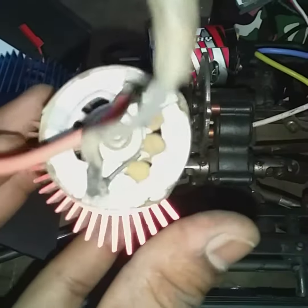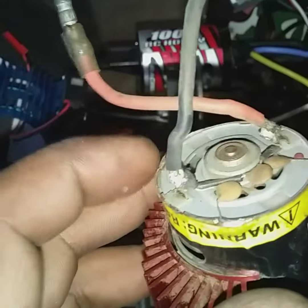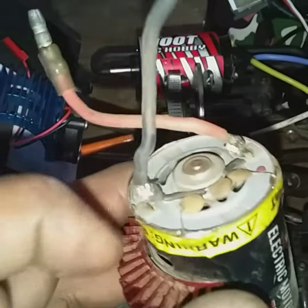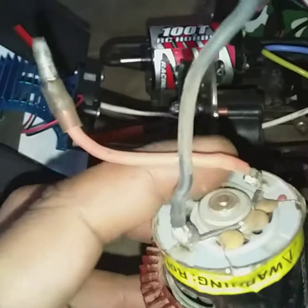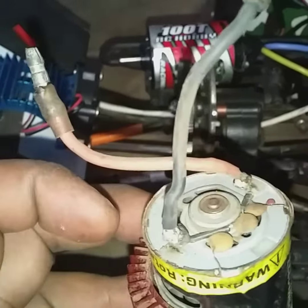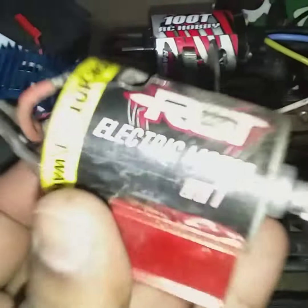Yeah, I'm sure it's just the brushes burnt out there. I'll make a video another time showing you guys how to open this old back casing and take a spare brush from another burnt out motor. Because always in these motors, you'll get one brush that'll wear out more than the other — it's usually the positive that would need to be replaced. So if you take the negative from another motor and put it in there, you could have two good brushes and a running motor.